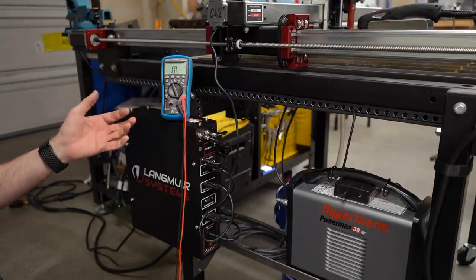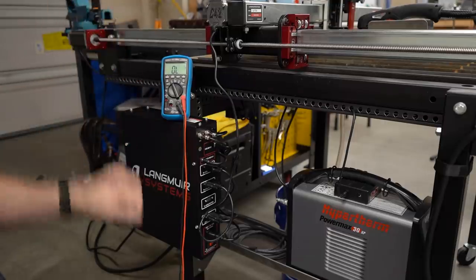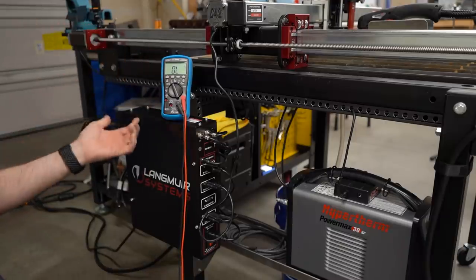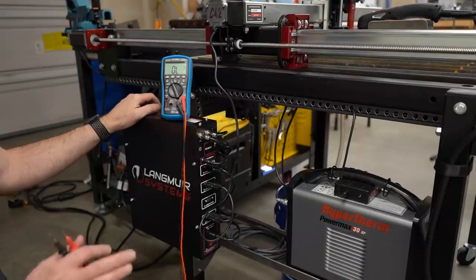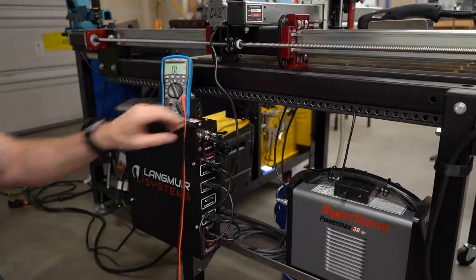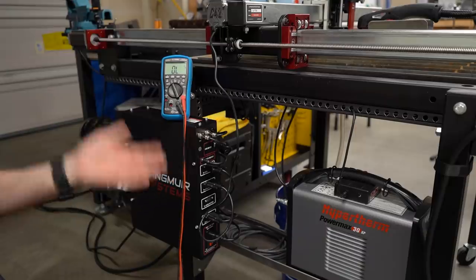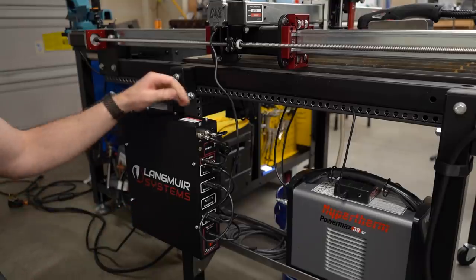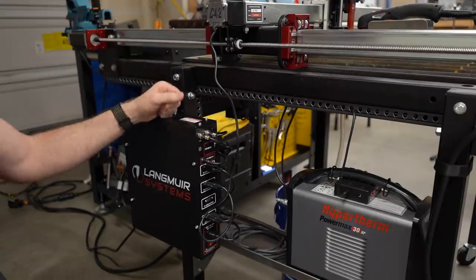So what happened here? I made a simple mistake and a simple oversight — I did not think about the fact that I was actually connecting the ground of the computer to the table, which the designers of this table have taken so much effort to keep isolated. It's just a dumb mistake and a simple thing. Honestly, I'm really glad that the only thing that happened was that the torch height control was reading zero voltage, so the software detected that, and as soon as the torch started, it didn't see the voltage rise and it just shut down and powered off. I'm very pleased — maybe a little bit surprised — but definitely pleased that nothing got damaged, and once I got things isolated again, everything seems to be working.